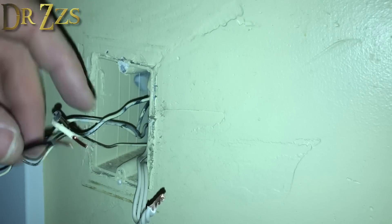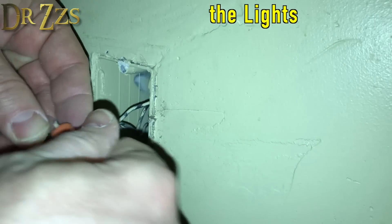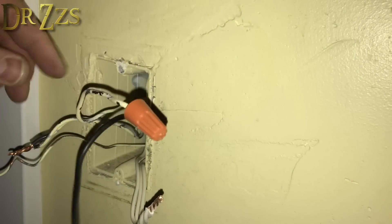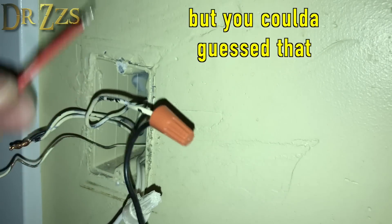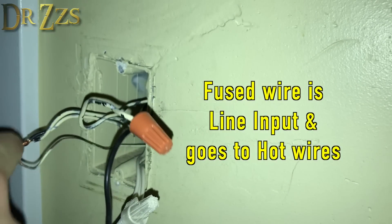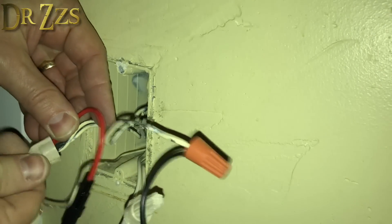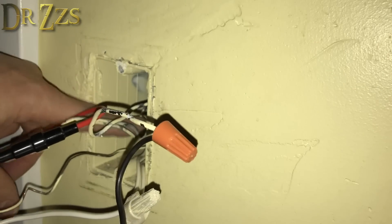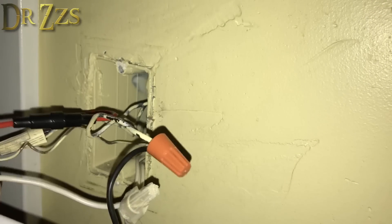This is the black wire that goes up to the lights, so that's going to get tight — I'm going to connect it to the line-out on my Sonoff. Output side goes to the light, neutral connects to the neutrals, and the input goes through my fuse and connects to the black wires from the circuit breaker. Now I'm going to stuff all this back in — I've eliminated a lot of stuff because my switch plate is really just this touch module, and it fits diagonally in the box just fine.